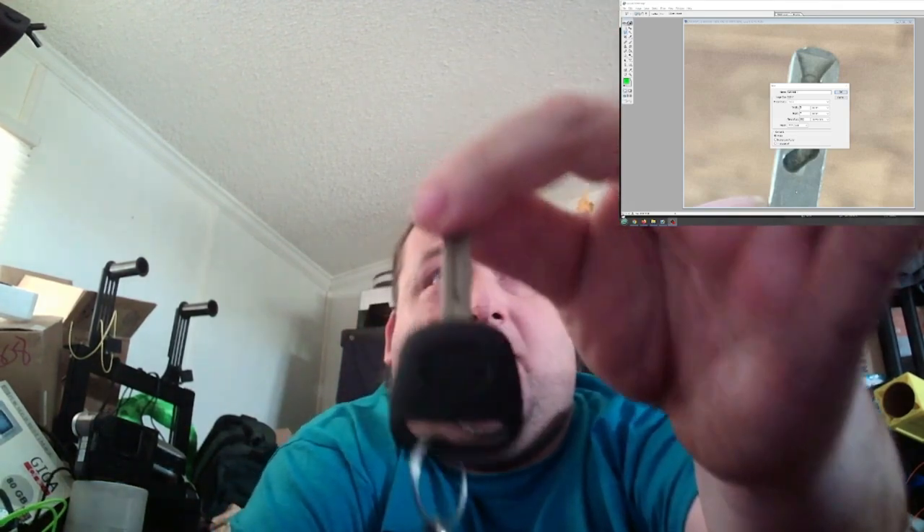This key is a standard shape — it is seven millimeters wide, possibly 7.5 millimeters wide, by three millimeters thick, and it's three layers, one millimeter thick each. From the end I'm going to create three one-millimeter wafers: one side has the bitting, the other side has the bitting, and the center is just a square shaft. It is insidiously easy to duplicate car keys.